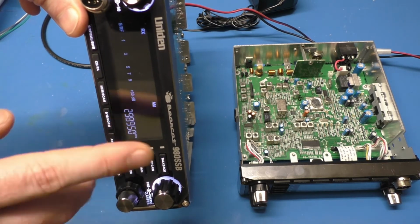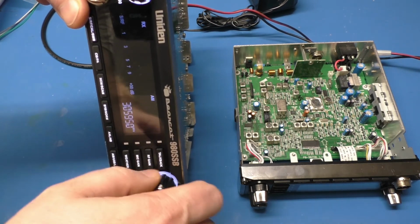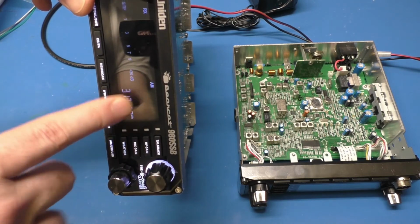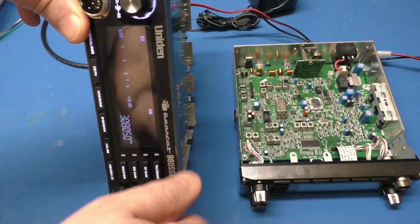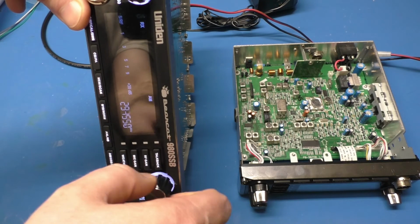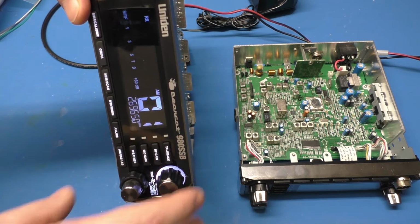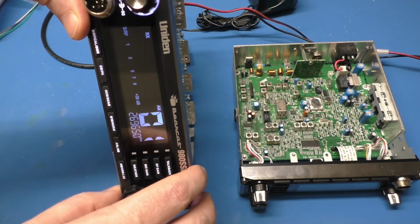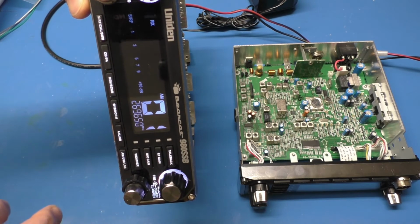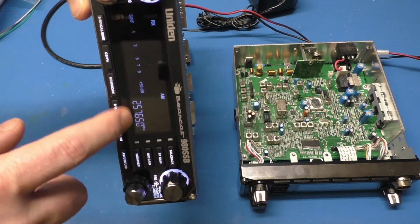Keep in mind, it receives flat through this whole range, except up here. The receiver actually dies up here. I think the VCO actually stays locked up to around 30 megahertz, 30.5 megahertz. I don't have a lock-unlock indicator on this, so oh bloody hell! It just doesn't keep the last setting, because I've been debugging this, so it just doesn't store anything. Because otherwise, I'd kill the EEPROM. But yeah, as far as how low it goes, down in the 25s.